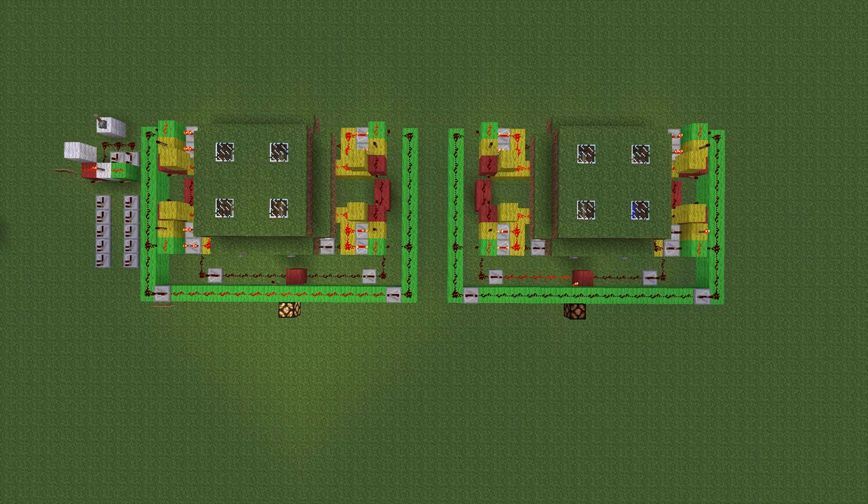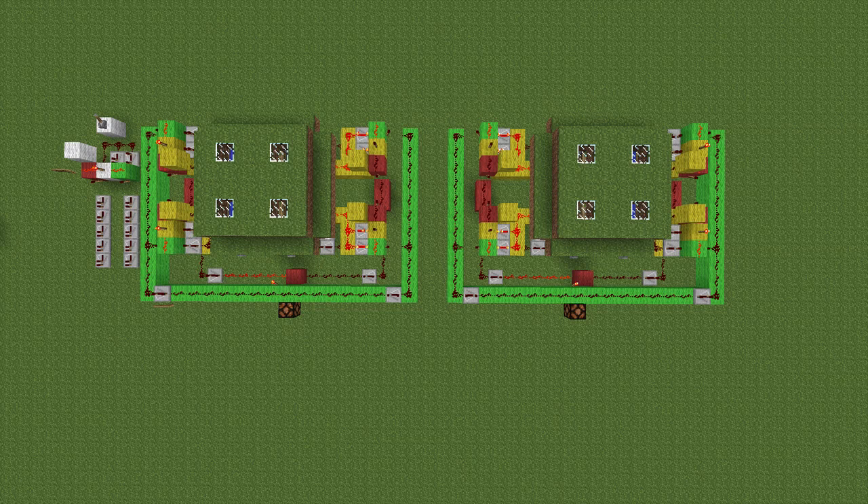A couple of quick comments before I sign off. The whole circuitry on the outside can be made much simpler if all you care about is having the lights turn on when it gets dark — just take all those outputs and hook them through repeaters to a common bus, giving you one big OR gate. If any of them turns on, your lights turn on. I chose to go for the bigger, more complete version just because I could. If anybody knows how to make the complete edge-triggered version a little smaller, let me know. Thanks so much for watching, subscribing, and for all your comments — I look forward to doing more cool stuff soon.